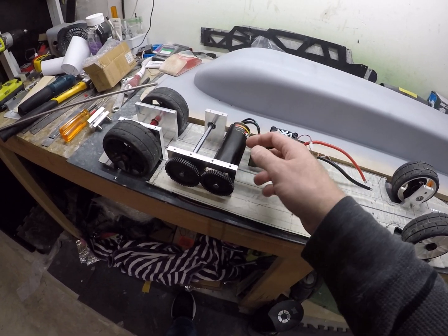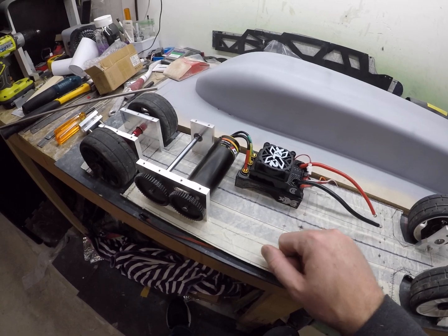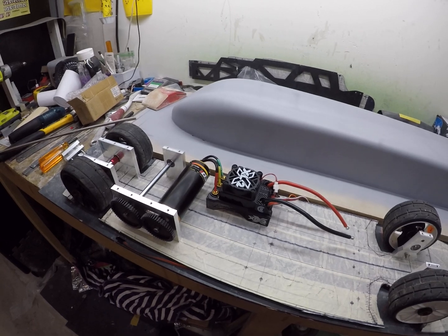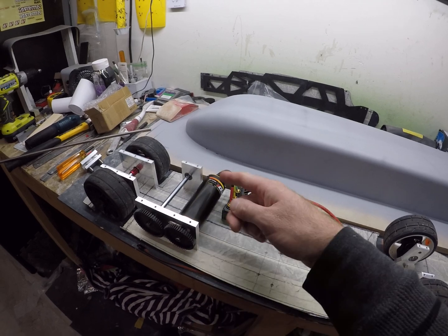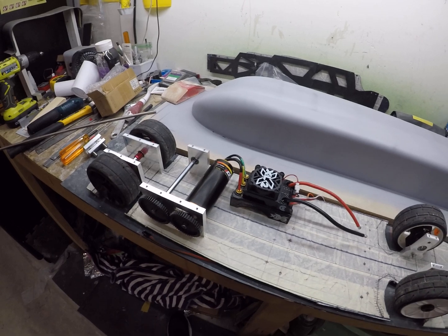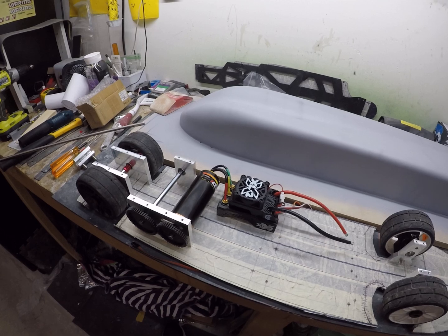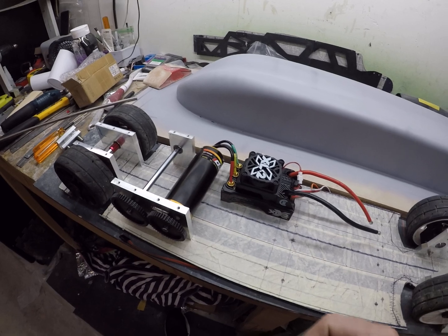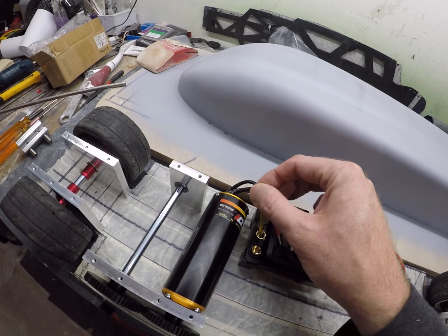This motor is around 800 KV — it's a 7A. If you're familiar with motors and the wiring involved, lower KV is often done by having smaller, thinner wires but more windings inside the motor. I've had lots of motors from around 4,000 KV down to 1,400 KV on a TP 5660, a fifth-scale motor. I didn't expect these wires to be so small.